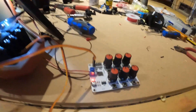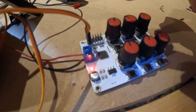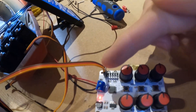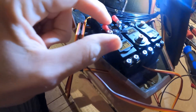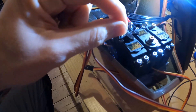We've wired up one of the servos just to see if it works. We have a servo board here — by turning these dials I can turn the servos. This dial here is connected to this wire. The brown and red wires are power — plus and negative — and the orange wire is the signal. This wire comes down here and into this servo. The servo here has two of the tendons connected to it.